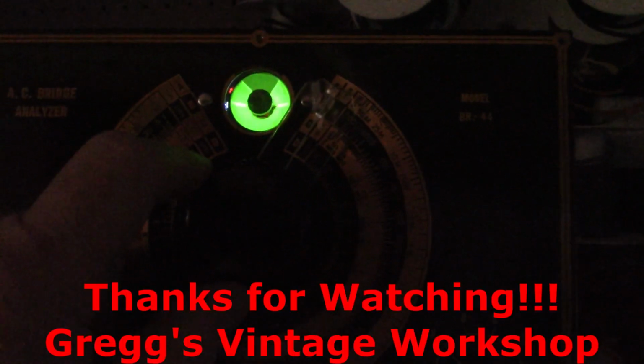I need to get this thing mounted back into the case, but I need to try and adjust a couple of things on it first. But I did want to show you that this is working properly now. I want to see if I can adjust a couple of those resistor values I have in here. I couldn't read the resistors, so I estimated. And I want to use my decade box and see if I can make things more accurate. I've got it so that when I'm testing a resistor, I put a 100 ohm resistor and it opens the eye at about 130. And I have it set so a 1000 ohm resistor is right on the money. But when I go down to a lower value or up to a higher value, it goes off a little bit. So I'm going to see if I can play around with some of that and see what we get.